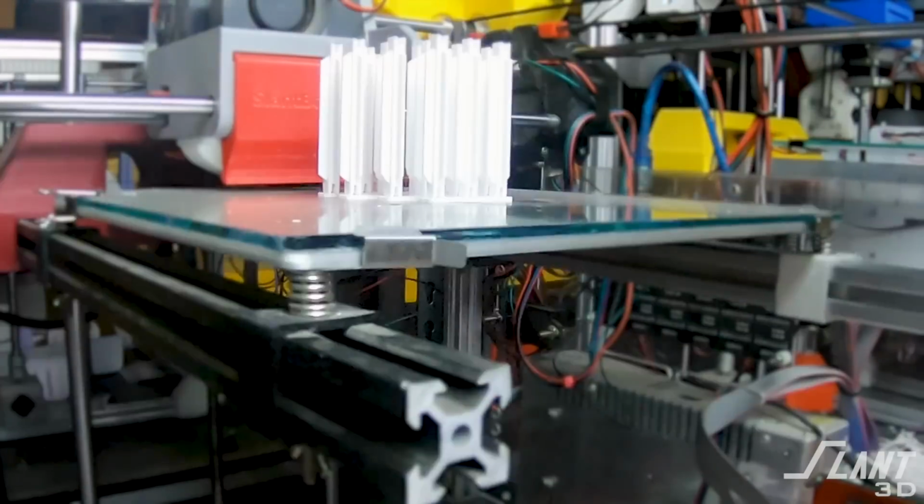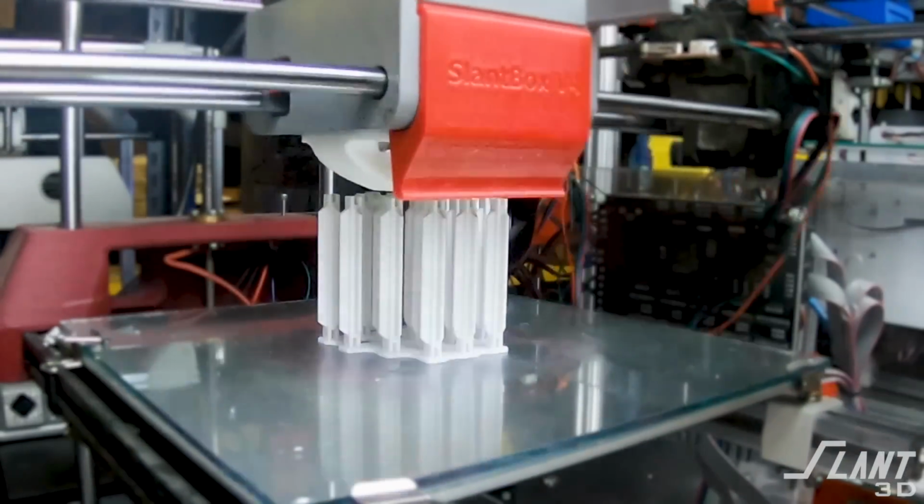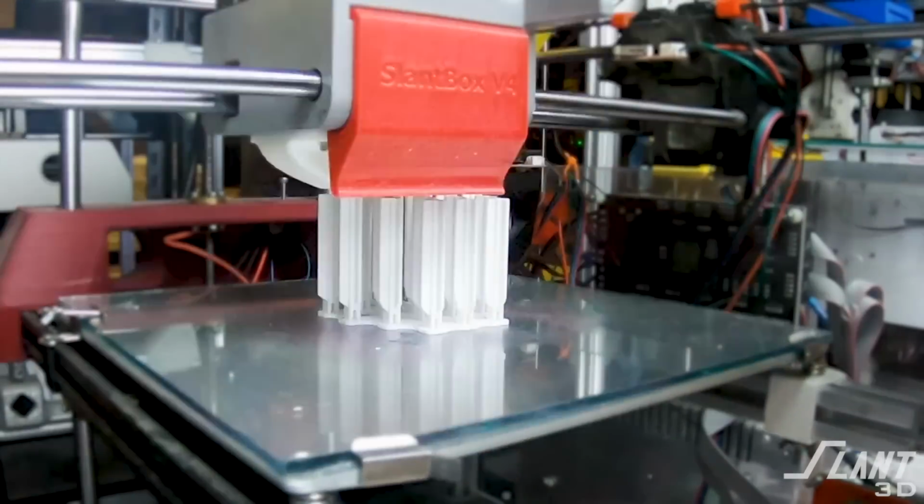The other issue with a large flat part like this is that it is very well adhered to the print bed. So it has almost no scalability at all, because each time a part is done, it has to be removed from the bed by hand or through some other fairly intensive process to separate it from the bed. We generally try to pursue auto ejection, which is a part being removed through automated methods from the printer once it is done printing. And we can't do that when it is large and flat and broad like this.